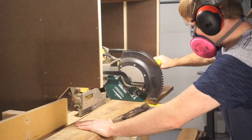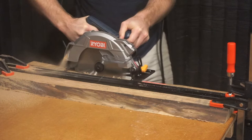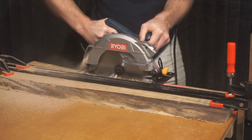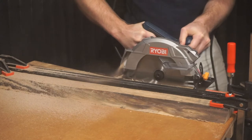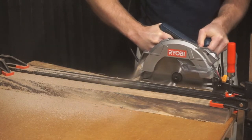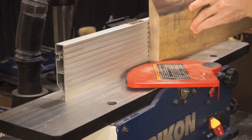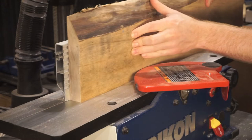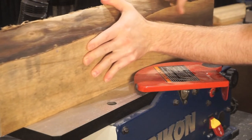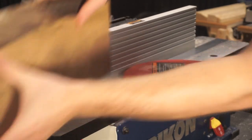After cross-cutting this piece of walnut to size, I took it over and clamped it on my table saw workstation and cut it out with a circular saw and a straight edge to get a nice straight edge on the piece of walnut so that I can run it through the jointer and table saw safely and accurately. Once I had an accurate straight edge, I headed over to the table saw to get the other half of the live edge cut off.